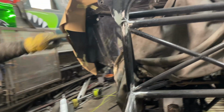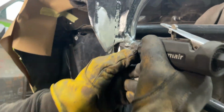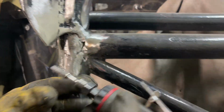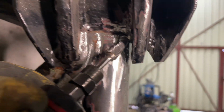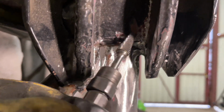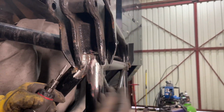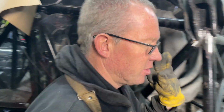And that gets really annoying and it really vibrates, but that's the only way we can get underneath because we're leaving the bracket on and we want to remove all the old tubes. So we've been going under here, clearing it all out, and then if you look through here, we've cleared it all out so when we weld it, we can weld back up in here. So I've still got some cleaning to do with this just to get rid of all the paint, but that is all the tube removed, so now we can weld all the way around it when we put it all back together.